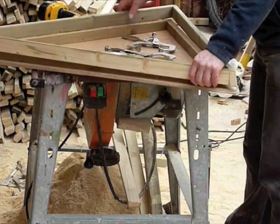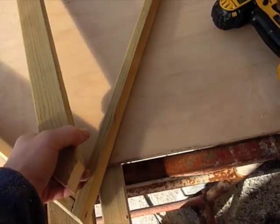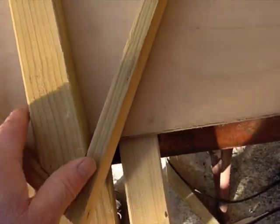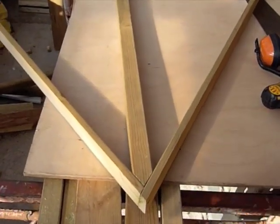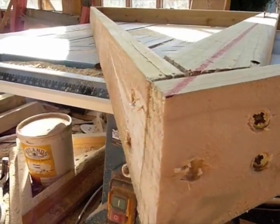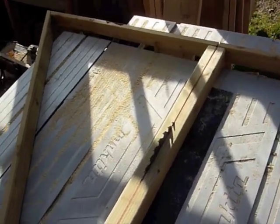A bit of timber here — it's about half this thick. This actually doesn't matter how thick it is because it works whatever size timber you use. What you do is you cut it with a point on one end, flat on the other, and you just insert it in there. Line it up — I have a little mark — so it's in the middle. That's then got a stud down the middle of our triangle. I'm going to screw that in. We screw that in to the end with screws. Keep away from the centre because what we're going to do next is put it on the saw bench and cut it down the centre. That way we get a left hand and a right hand of a half pentagon.